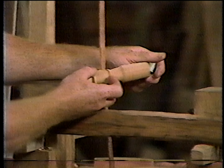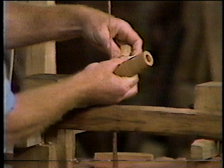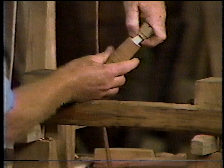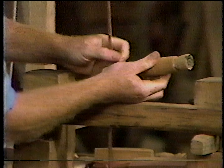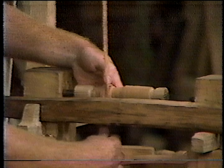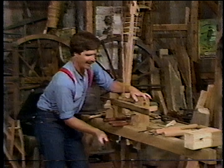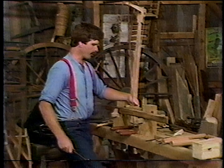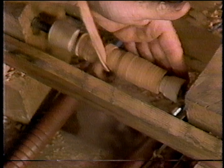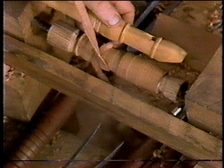Here's one I've started roughing in the lathe. To mount it, I've turned mandrels — you can see this one's been used in a mandrel-driven footwheel lathe. You can use it on any kind of lathe. This is the first trick: you bore the hole first, then put these plugs in the end like this. Put plugs in the ends and mount the whole rig in the lathe. You can see the leather strap that runs the lathe doing the turning. The holes are bored through the center, the mandrels hold the ends, and now it's perfectly concentric — you're ready to start turning.